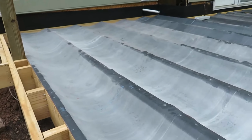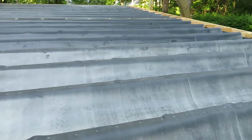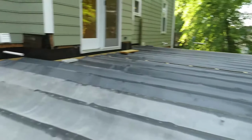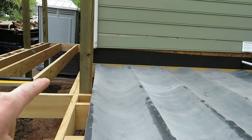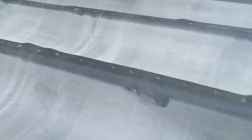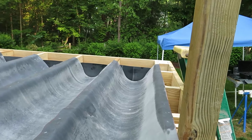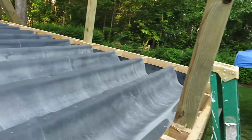Starting the morning off with a check-in on the waterproofing. While I was working on some backfill yesterday, my other two guys finished up all of the main troughs or bladders. So you can see how they all look, and this gives you a better idea. You can see, I think I said already, they're cut 18 inches wide at the top, so just a very slight droop up there. And then they get a lot deeper down towards the bottom because they're 24 inches wide at that end. So we get a nice constant flow of water anywhere the water gets in here.